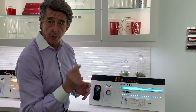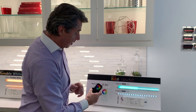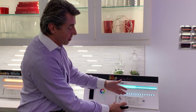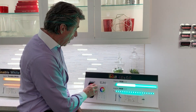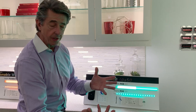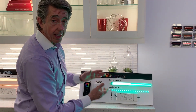The Inspire RGB 6.0 is 6 watts per foot, and this product actually has 56 LEDs per foot. It's a new RGB chip, the 35-35, and the benefit of that is it's a smaller package so we can put a lot more of them on the tape. This is an RF system — radio frequency. This is the wall control, this is the decoder, and they also come with a remote that you can use to change the color. This system also comes in a DMX option, so there's a Cat5 cable that runs between these. If you're in a commercial space or an RF noisy space, you would want to use the wired system just to ensure that it's communicating perfectly.